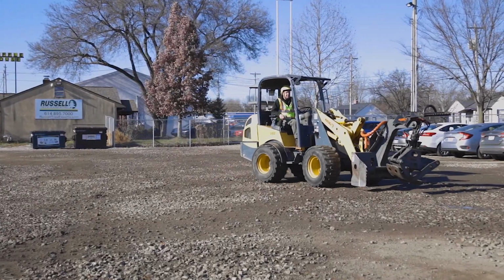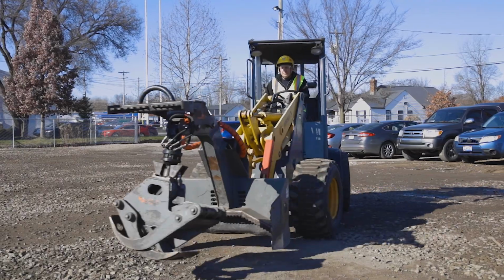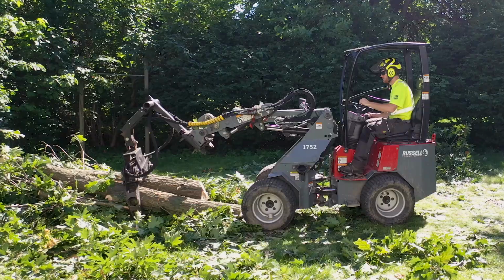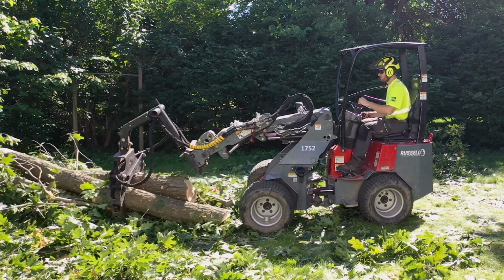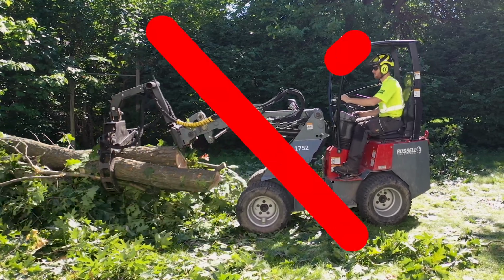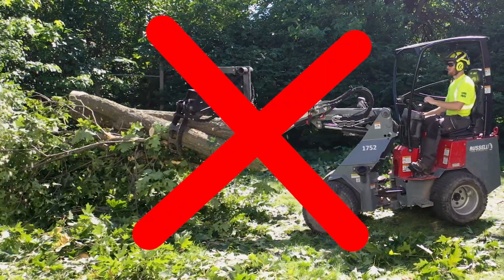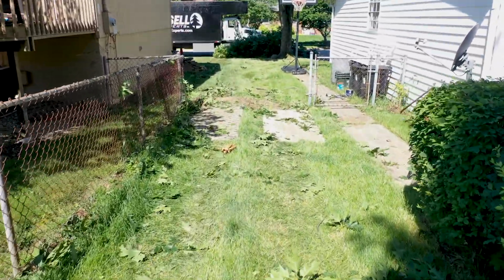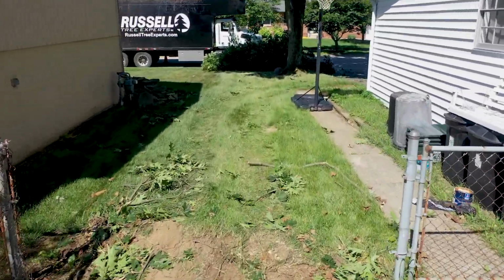When driving the articulated loader, avoid sharp turns while carrying a load, as turning can easily change the center of gravity. If you feel any change in gravity, let off the accelerator pedal and put the load down. Driving with the heavy end going upward will help avoid changes in the center of gravity. Be aware of all ground conditions such as moisture, soft spots, change in ground material, and change in grade.